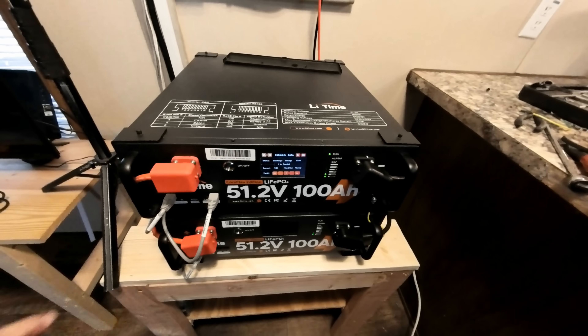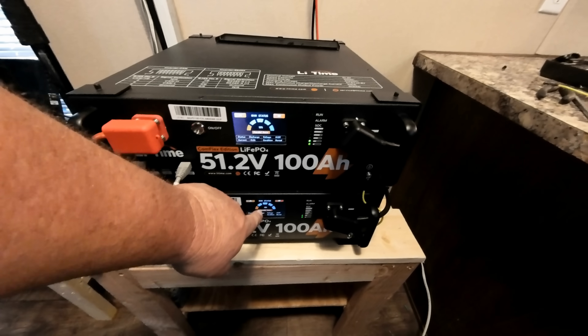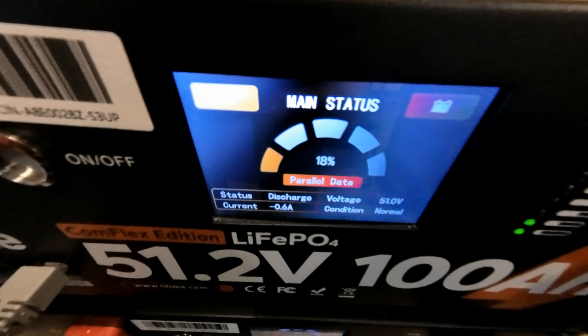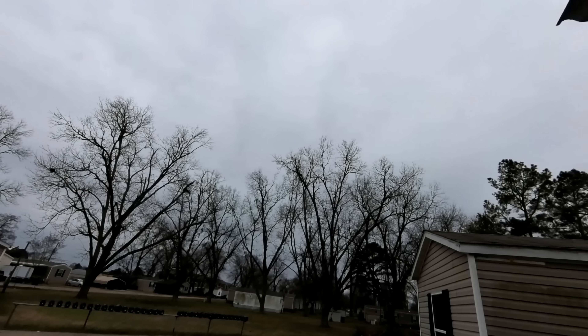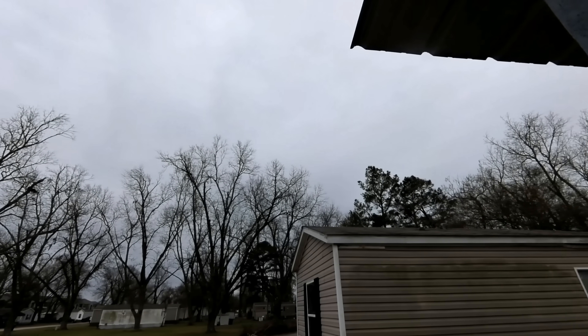We have powered up the batteries. They're sitting pretty low right now because I had them running for the last two days just testing them — we're down to about 18%. Right now it's only showing 79 volts coming in. It says that we're charging, but there's only four amps coming into the batteries. It is just an absolutely crazy cloudy day today — there's absolutely no sun out here. It's January, it's cold, and this is what you get. We're only fluctuating between 100 and 300 watts.